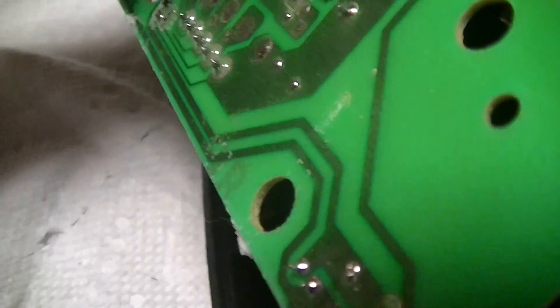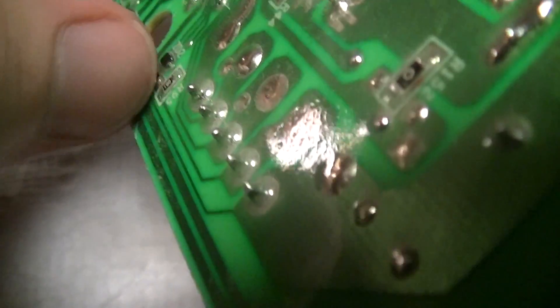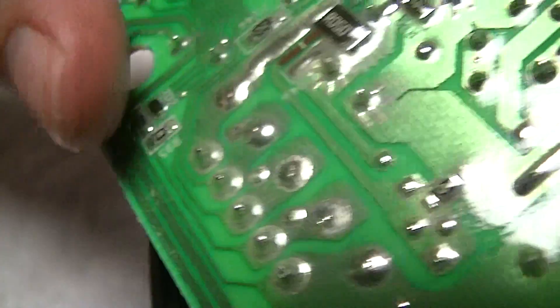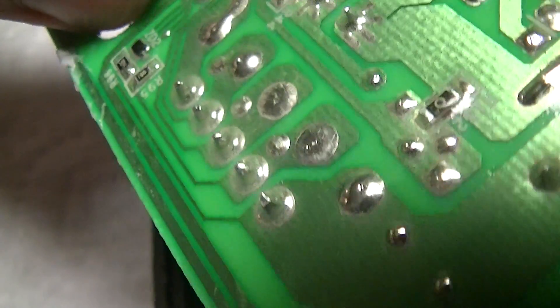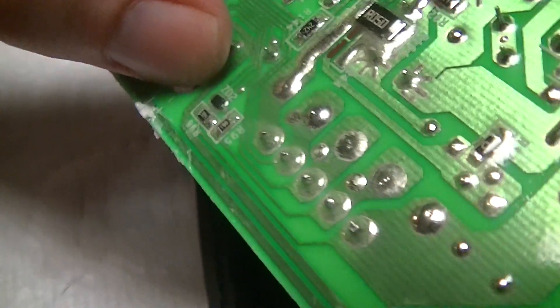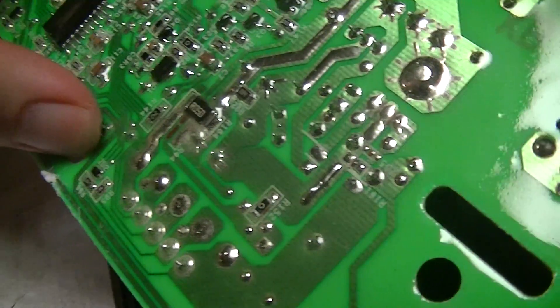The T line is green, and tracing it out — the green wire goes to a resistor divider chain and a Zener diode. The D data line appears to have some kind of input protection from the microcontroller — probably a Zener or similar device. My plan is to put a scope on that data line and see what the communication protocol looks like at some point, but right now the risk of electrocution from the exposed charging terminals means you need to be careful with test equipment — you could die.